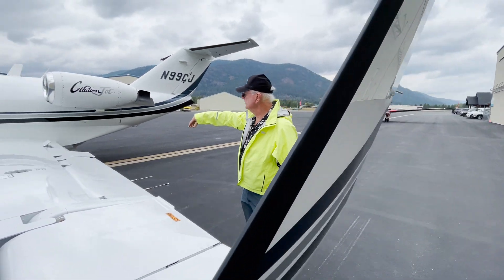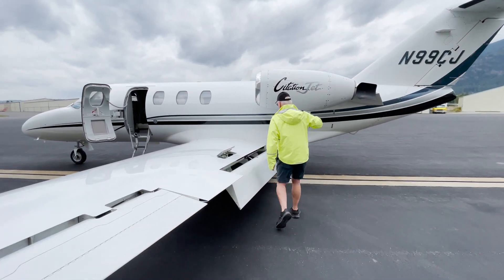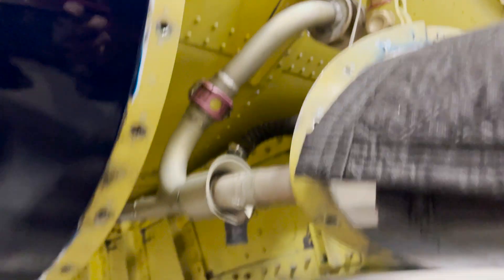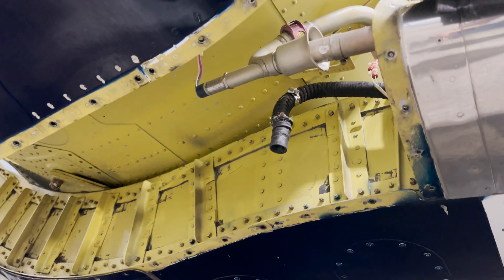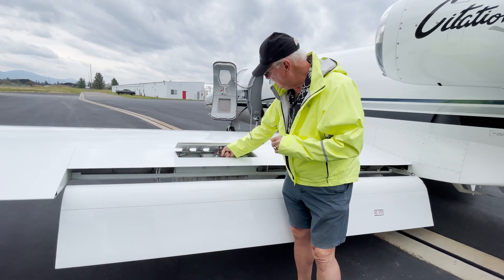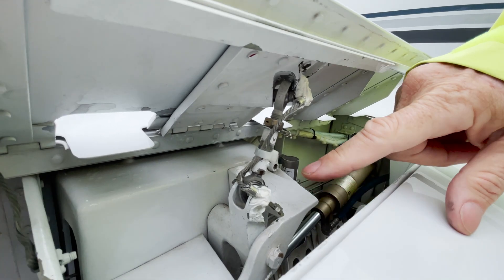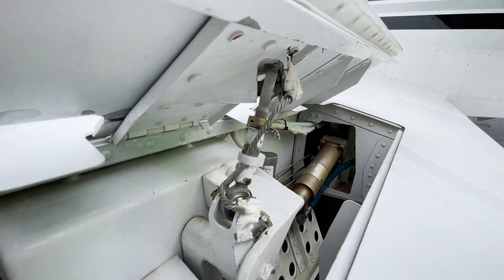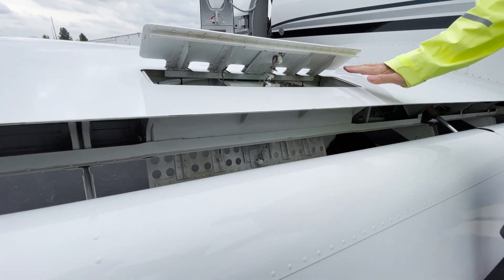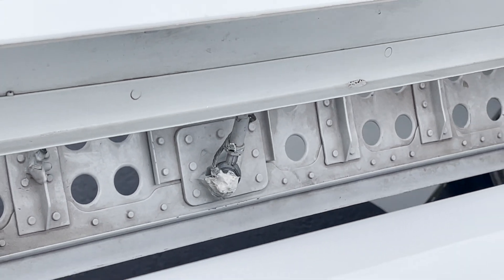In the belly, inside, they did a little wiring. Also inside the belly up front is where they put the ATLAS control unit — the ACU. Nothing else on this; we're just checking the plane. I like to check these static grounds here — these are important to do. The best way to do it once you land sometimes is flaps all the way down, leave your spoilers up so you can check those. But that's really basically our check. When we check the other side, we'll go check on the other winglet.